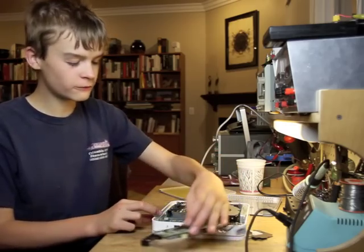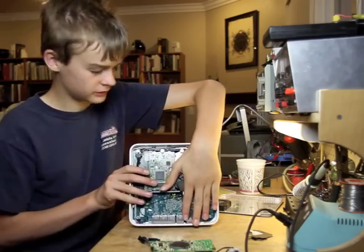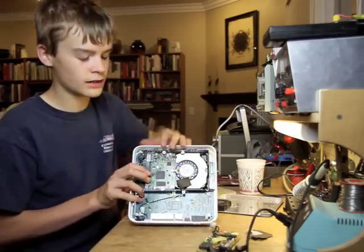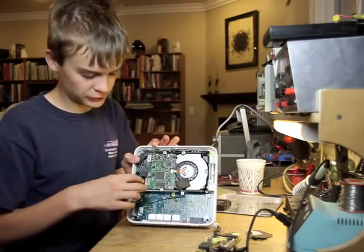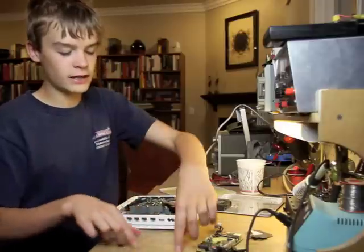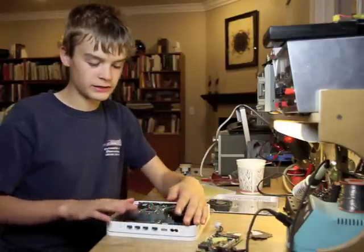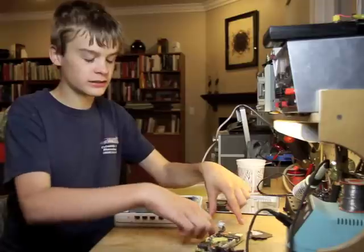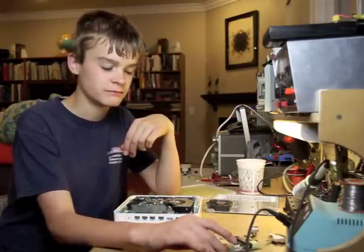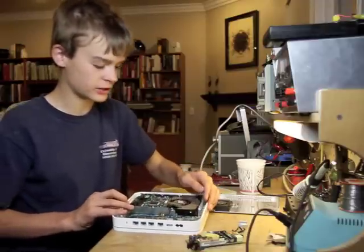So here's the thing — fixing it. Your first option is to get a power supply into this little space here, but remember you don't have that space because the fan is there, and you can't get anything that small unless you order it from the company, which I don't think I'm going to do. Your next option is to run wires out through here and have a tabletop power supply. They still use standard hard drive connections. It just sits outside and provides 5V and 12V, but I found out you can't really get those very easily — they aren't that common, and they're quite expensive to get the amperage I actually need.